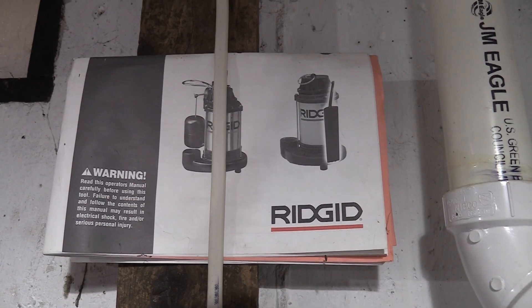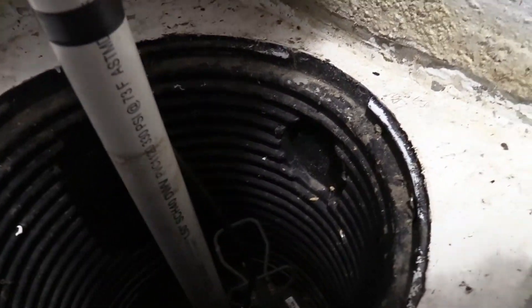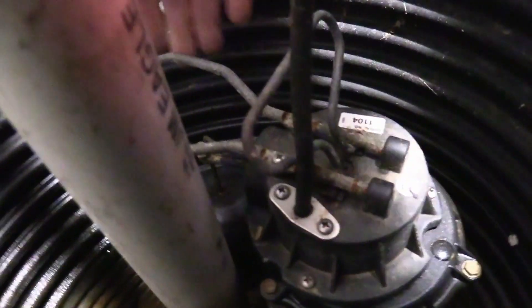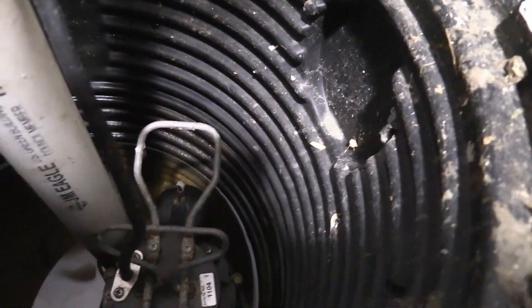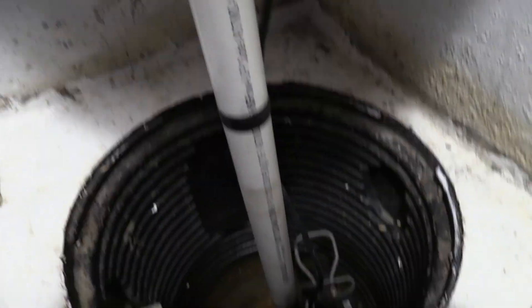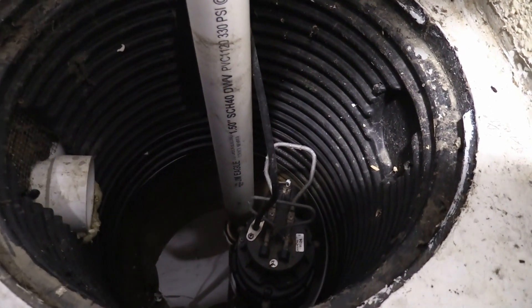So, this is what I had for a sump pump and what happened was that the float has messed up. I'll see if I can show you without dropping my camera in the water. The whole float is kind of just flopping around. What happens is it gets jammed and when it gets jammed it won't turn the pump on. I'm sorry there's not a very good photo here. It's just the float turning it on and off, and what happened was it got jammed and didn't turn the pump on - I had about two inches of water here.